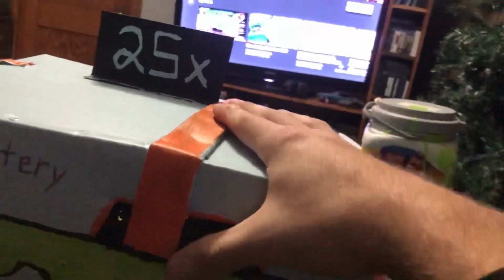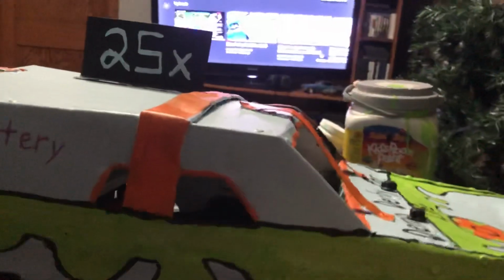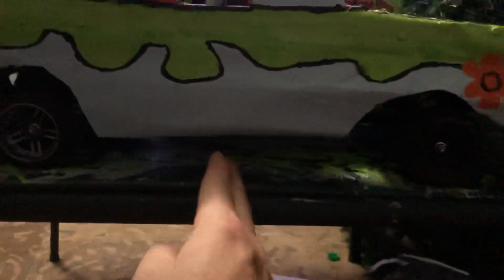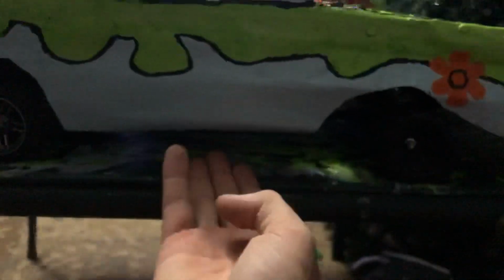That's also why you put in a halo bar. This halo bar, you don't think it would do much, but this actually helps a lot. This keeps it stiff. It keeps it from getting pushed in really bad. All you do is, I did it I think like 1.5 inches wide, and then you do it 3 layers thick. So you basically cut your sheet metal into about 3 inches wide. You fold to 1 inch, to the other 1 inch, and then you fold again. And you just pound it tight, and then you got your halo bar.